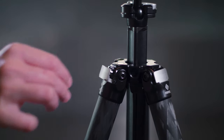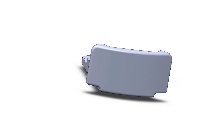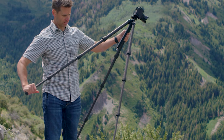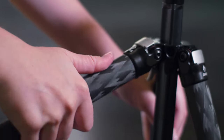We started by looking at the pull tab mechanism. To address all of our concerns, we came up with a new mechanism that uses magnets for pull tab retraction. This enabled us to save a lot of vertical space, which also reduced weight. Because there are no moving parts inside, we were able to get rid of the effects of fouling, and as an added bonus we were able to add a fourth angle stop to the mechanism.